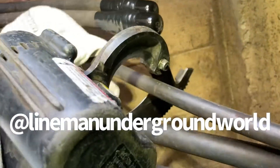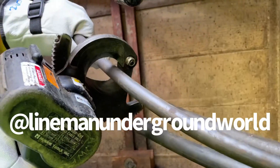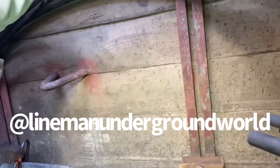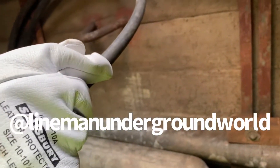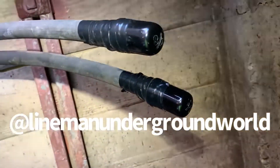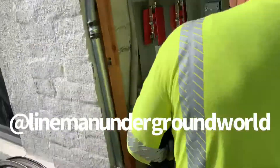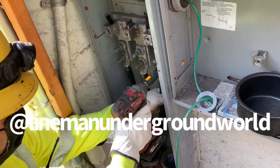All right, let's go cut it. Awesome. Always put your hand at the end — attaboy, there you go — so you don't zap yourself in the ear or something. Even though it's the neutral, you do the same thing over every single cable. Since we're down there on the other side, we de-energized it. Just going to leave the rest.